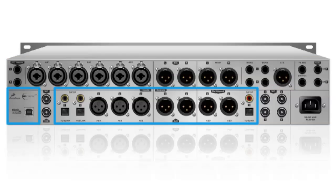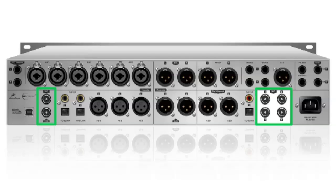In the digital section you can find one USB port, two SPDIF, two Toslink, and three AES-EBU inputs, two main AD AES-EBU outputs, and four de-jitted outputs on two AES-EBU, one Toslink, and one SPDIF. The Eclipse 384 also features a word clock and an atomic clock input, as well as four word clock outputs that can be clocked independently by whichever clock you select.